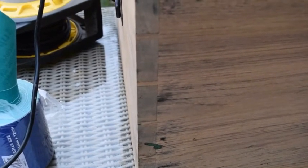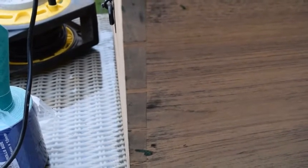Around the side here you can just see the quality of the woodwork. The dovetail is wider there because that's the end of the dovetail, with little narrow gaps between. Dovetail jointing is worth looking up to get a clearer impression. It's quite often used on drawer fronts in older furniture because when you pull the drawer front the dovetail gives it strength and stops you pulling the front off the sides of the drawer.